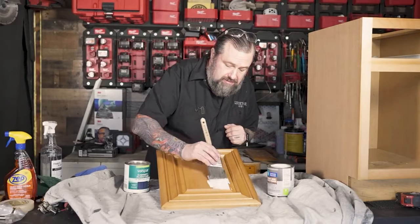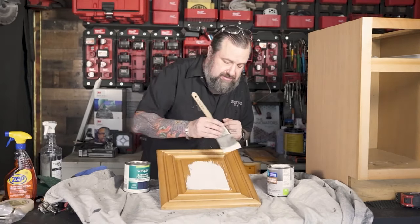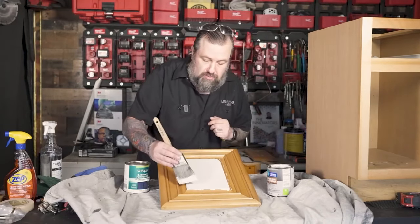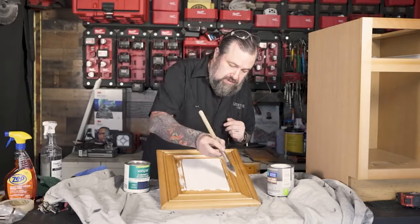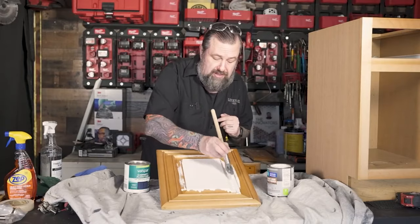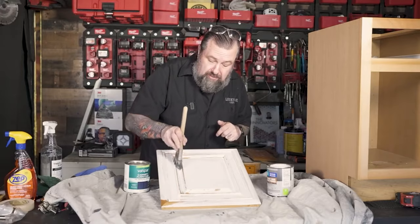The nice thing with these types of primers and paints is they've really been designed to lay out flat as they dry. The goal is to get it to lay out really nice so you'll have fewer brush marks. You can also roll this on, but I've got too many grooves on this that it would show. One trick if you're doing a dark color: you can ask for people to tint that primer — that means you don't have a white coat underneath, which could be a more durable option. This is also the time to look for any fish eyes showing up. If I see some, that might require a little more cleaning.